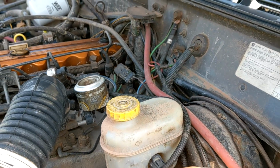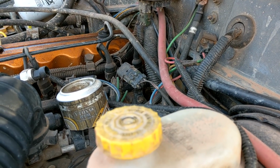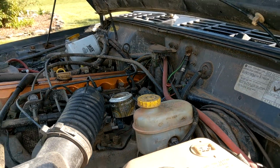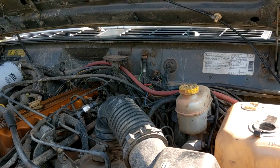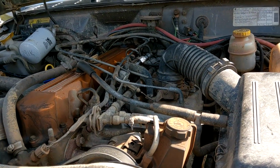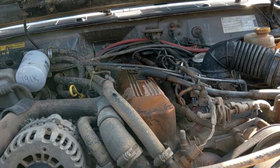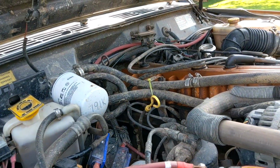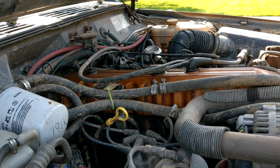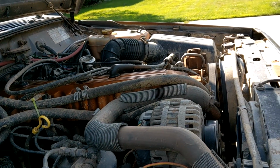So there's a few things that we need. First, we need to know what the reference voltage is and what the reference resistance is, and that requires a resistor. In a newer version, I might make that simplified so that the TFC can do that automatically. You don't have to put resistors in there and check things. But we need a couple more data points in order to properly figure out what the resistance is. Reading in temperature sensors is really hard, believe me.